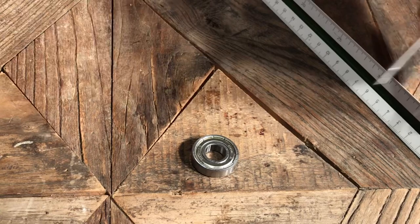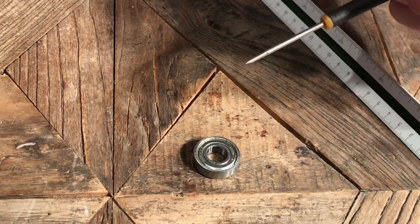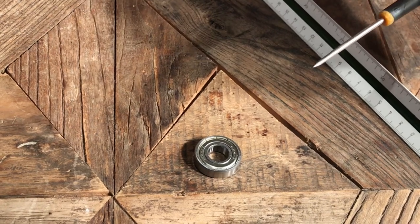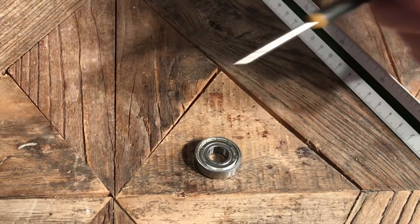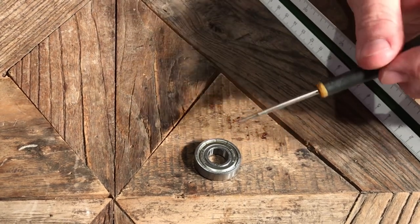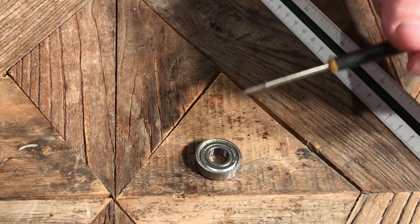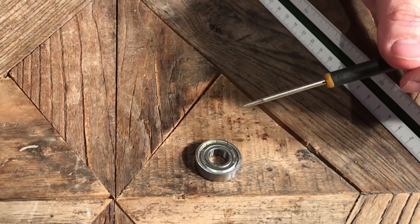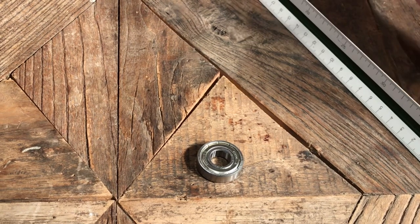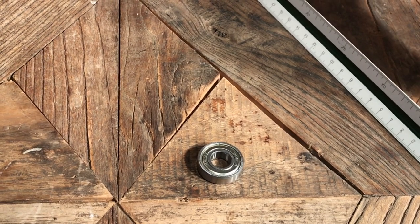It's actually not as hard as people think to find correct ball bearings — it's a very standardized sort of thing. Ball bearings have all kinds of applications beyond strollers, like skateboards and all kinds of different things. That is how you go about finding the information from your ball bearing so you can do a Google search, verify dimensions with a ruler, and then purchase new ball bearings for your stroller. We hope this video was useful, and if it was, we ask that you subscribe as it helps continue making videos in the future.